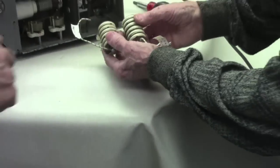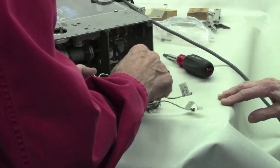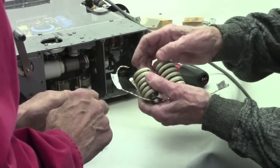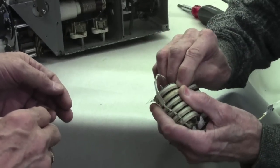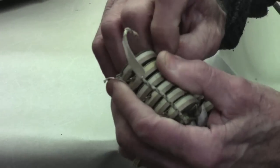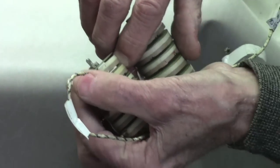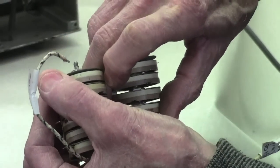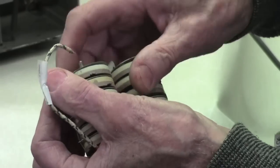But these capacitors are adjusted by moving this little tab. That is correct, and you can do that. There's a little tab here, and you notice if I take that and rotate, I can rotate that. I don't know if you can see this good. Yes, I can see. The bottom disc, the bottom ceramic disc trimmer, is rotating? Yes, rotating.